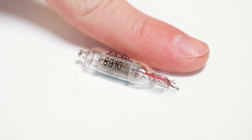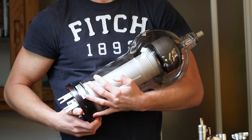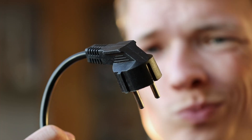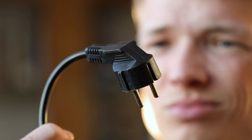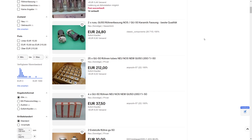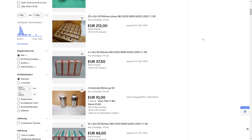There are small tubes, but also very large ones. Since we can't provide many hundreds of kilowatts of power, we prefer to stick with the small ones. Today we will work with the Pentode GU50. It is small, cheap and can switch quite a bit of power — perfect for a vacuum tube Tesla coil.